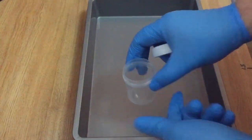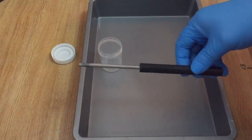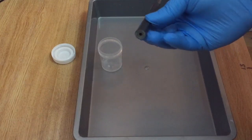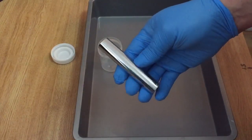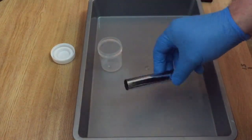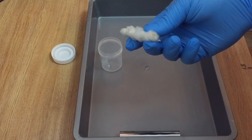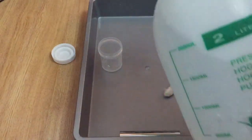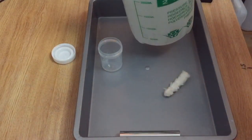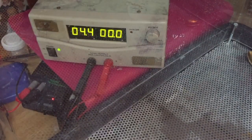I put a little bit in — about 20 ml. What I put in is a stainless steel electrode. I only use stainless steel for chrome stripping, nothing else. This is the chrome pipe. What I use to strip the chrome with a brush system — here we go — is a swab. You can get it on my website. There's distilled water, or in this case you can use normal water. This is the rectifier I use.